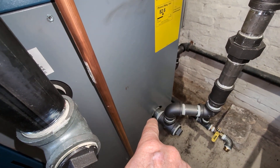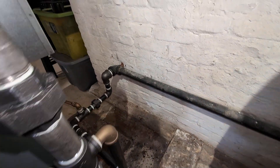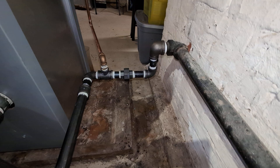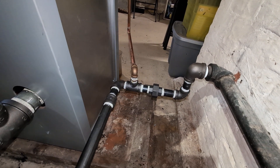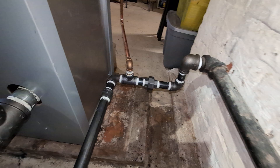There's the return right there with a plug for cleaning if necessary, and there's the drain on the new wet return. Here's the existing wet return and we've run it in one-inch steel. Where the makeup water feeds in, we've added a bushing of brass to reduce corrosion in that area.